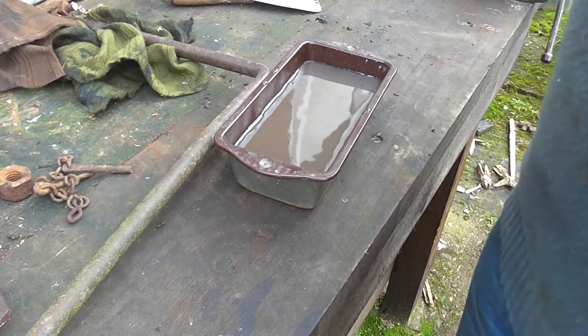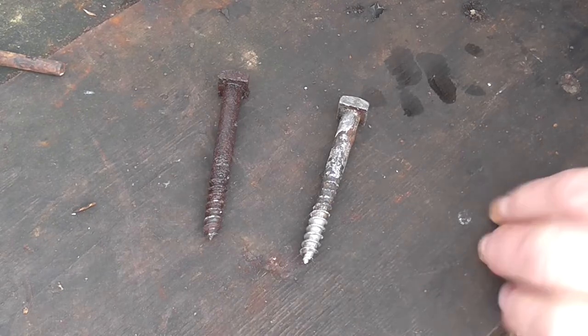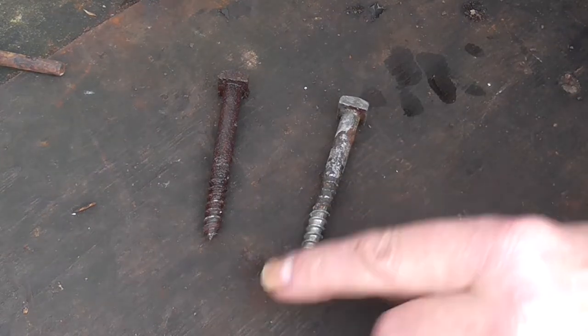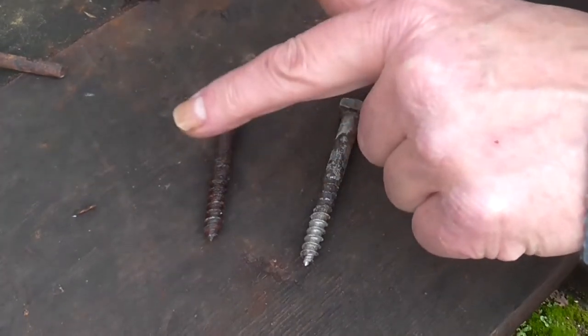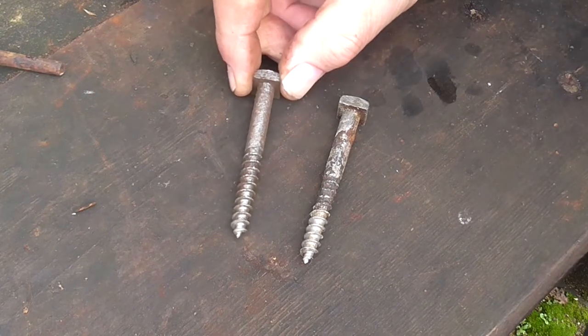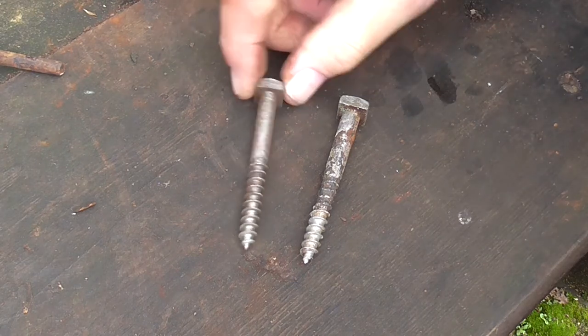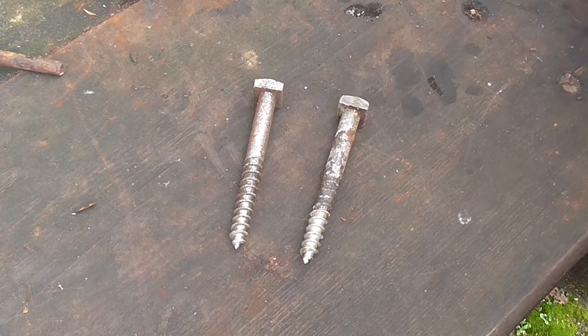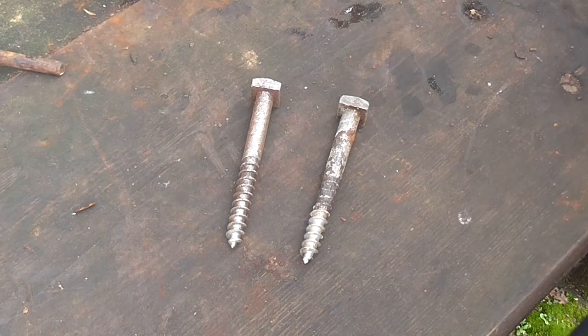As an example of the vinegar method, these two coach bolts have both been in vinegar — they're pretty badly rusted up. That one has been in the vinegar but I haven't washed it off yet and you can see the rust still on it, whereas that one is more shiny. I've just washed this one under the tap with a bit of soap, water, and an ordinary bristle scrubbing brush, and I think you'll agree that's got most of the rust off — it was really really rusty when I put it in. I'm not advocating you de-rust coach screws since it's probably cheaper to buy new ones, but for a special bolt it's one worth trying — the vinegar trick does work.